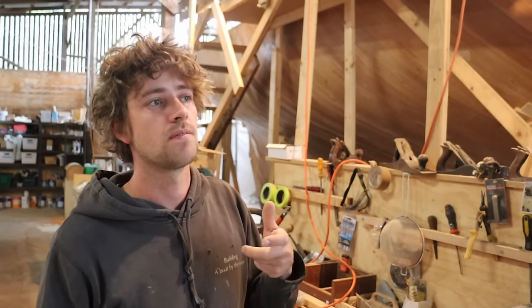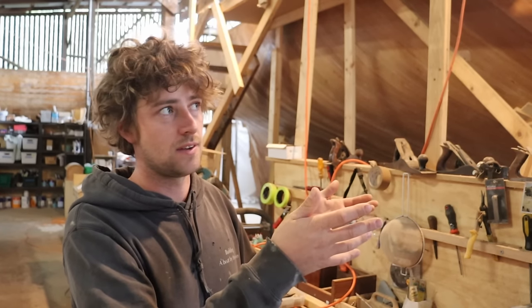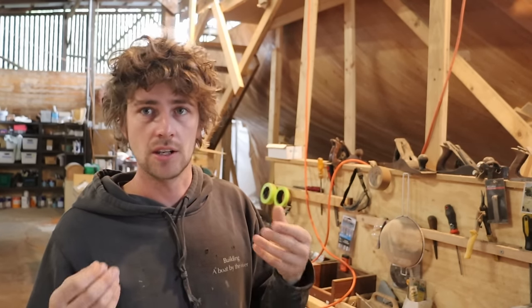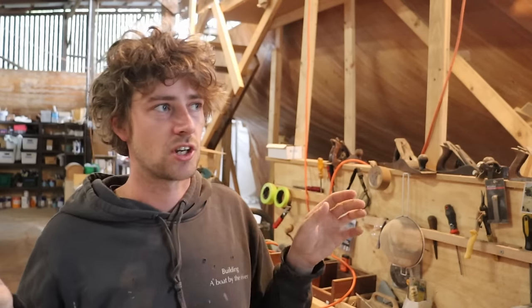So what could theoretically happen is that if we were going to lay deck planks on top of the cabin, we could rip them in half, split them, thickness them, machine them, make them all beautiful, lay the deck, and then if we lay them too quickly, I believe they will dry out and lose their moisture really fast in the heat of summer, because they're maintaining their sort of winter moisture content downstairs on the slab. They haven't actually dried out fully. So when we take it upstairs, they will shrink and crack, and it will be very sad.